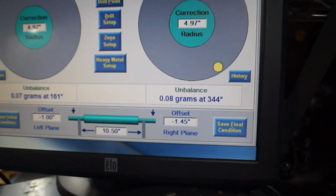Most people, I was talking to a gentleman from Sweden today, and he was telling me that, once they get below 2 grams, like 1.7, 1.5, 1.3, that's acceptable. Let it go. And yeah, that's acceptable to a certain degree. How much life do you want out of the engine? How much you want to reduce your internal parasitic drag? You can have good enough, acceptable, perfectly suitable, but you can also have perfection. And in doing so, it takes a lot of time and effort.